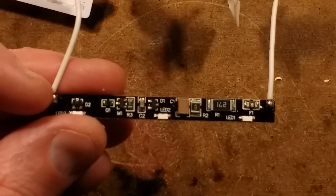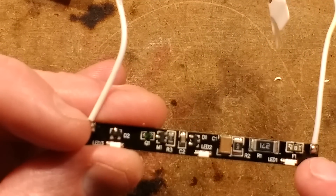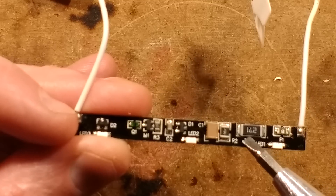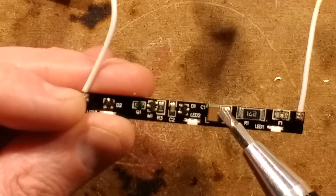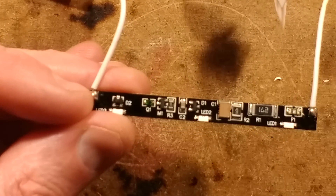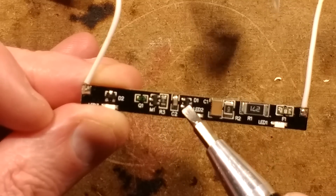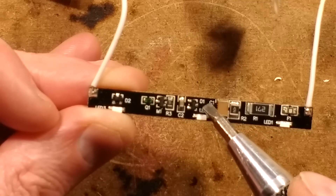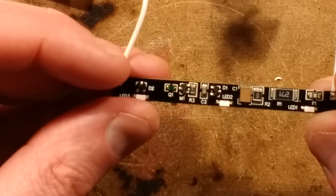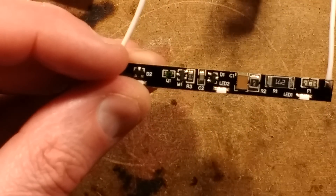It's a black circuit board. I can see this is marked B — I think that is a surface mount fuse. There's an inrush limiting resistor, a dropper capacitor — much bigger than the fake's — with a well-rated discharge resistor across it. Then it's more or less the same arrangement: I see the light sensor, a transistor, a resistor, the smoothing capacitor, and a little bridge rectifier made from two sections called D1 and D2. It's pretty much the same circuit, but with much better rated components, and three side-emitting LEDs along the front — the type normally found in LCD displays.